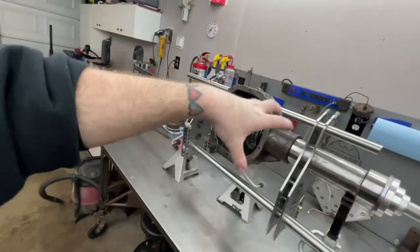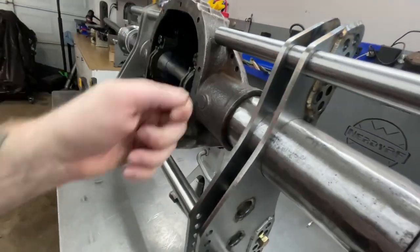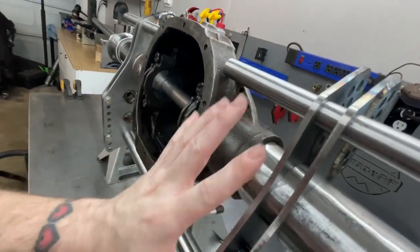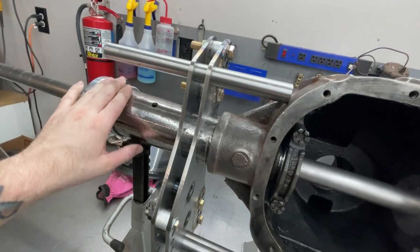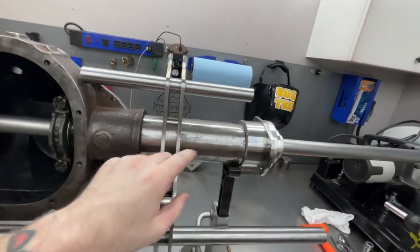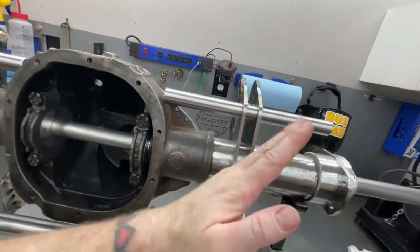If I hear any pinging — where it's trying to pull the material off the housing — I'll grind out that weld, grab my torch, heat it up, grind it clean again, and weld it again. I also have a heat blanket I can put in the oven to get to about 350-400 degrees. You grab it with welding gloves and toss it on what you just welded to keep it warm while it cools. Or use a heat gun to slowly cool it down. It's super important to weld the tubes first before anything else. Once the ends are welded and this still rotates freely, you know nothing is crooked.